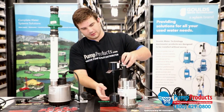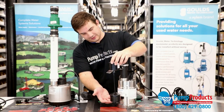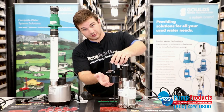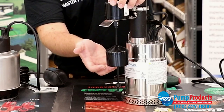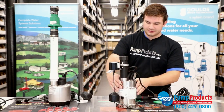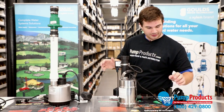So this is tightened. Once the water starts to rise on this, it's just going to rise up, activate the float switch, and cause the pump to pump down as it sinks down, turning the pump off. This is already wired into the pump — there's nothing else needed to be done. This is ready to go.